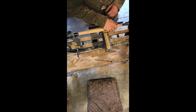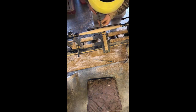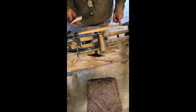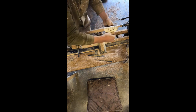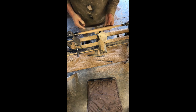Now we're going to start refining the shape and working on the little tenons at each end. Now that the final shape and the tenons are all done, I like to sand on the lathe, so I'll work my way through the grits. Then we can do a dry fit on the stool. Sanding's done so now I can cut the little ends off and we can get to dry fitting on the stool.